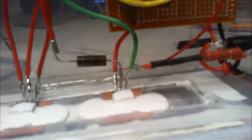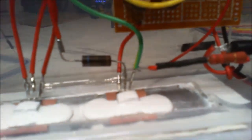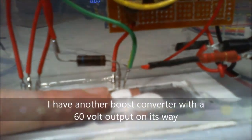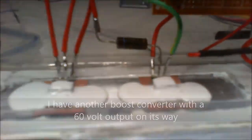And I've got my little LED ready there, and I'll just put a resistor on that and chuck that between the output current. So I just better calculate the resistor a little bit, I think, because I might be able to go up to like 57 volts with this. Not with those chips, but I've got some HV versions of the 317, LM317. So I might be able to do it with that.